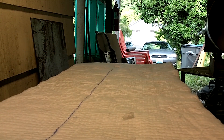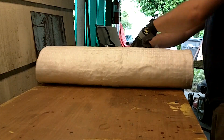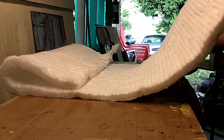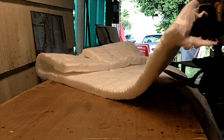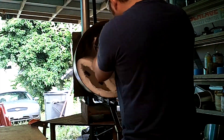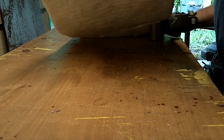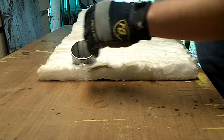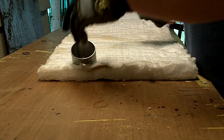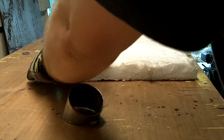I'm leaving a two inch gap at the top so the refractory will cover the whole lining, and I have a four foot by 14 and a half inch piece here I'm going to cut out. Now I'm just dry fitting it and getting the form for where the burner tube is going to be. What I did is I made an impression by pushing the material on the burner pipe installed, then I used the cutoff piece to make that easier to cut out. It actually worked very well.